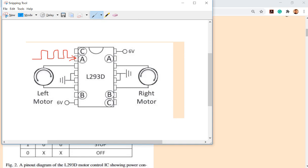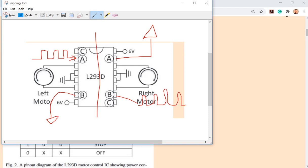There are actually two pins for each motor terminal. You ground one pin to make the motor rotate in one direction. If you ground the other side, it rotates in the opposite direction — clockwise or counterclockwise — depending on which pin is grounded and which is activated. You don't have to do this manually for the car because everything is highly integrated — you just use the functions. But you need to know what's going on. The driver used for the car has two drivers inside one IC chip to drive two different motors.